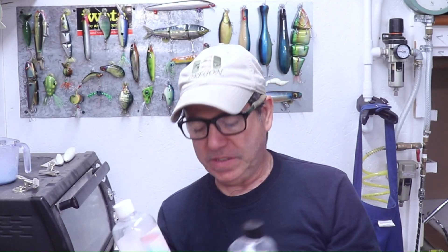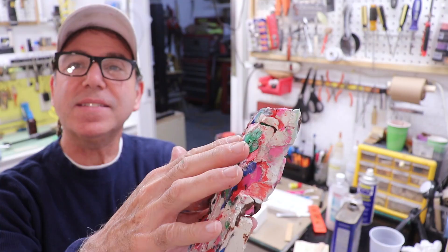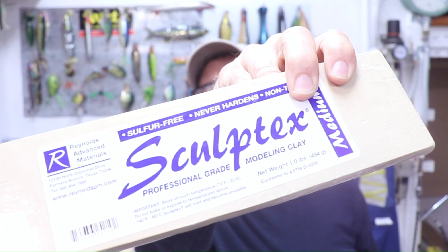There was one other loose end - the ultimate judgment on the product test for this sort of off-brand silicone. It set really well and has a very low viscosity so it pours out really smooth and doesn't hold bubbles at all. But the question remained at the end of that last video on whether it was platinum cure or tin cure, and whether that was the issue with the silicone dissolving the clay I was using and staying gooey. My theory is that this stuff is platinum cure, and if that's the case I need sulfur-free clay, which I went ahead and ordered.